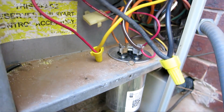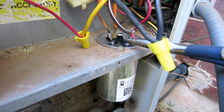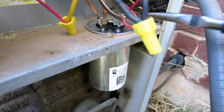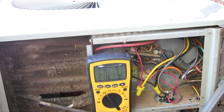So some safety tips real quick. After you turn off the power, it's always good to make sure that the run-start capacitor is drained out. So you want to touch common to herm — make sure that's drained out. And you want to touch common to fan. So for the fan, we have common, start, and run connections. And on common, the brown and the yellow are at the same connection points according to the schematic.